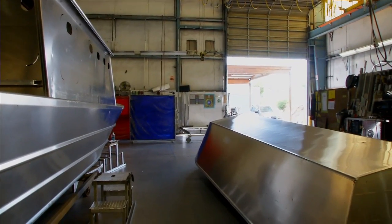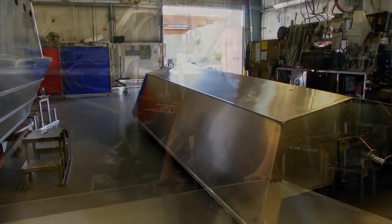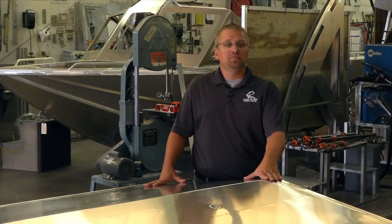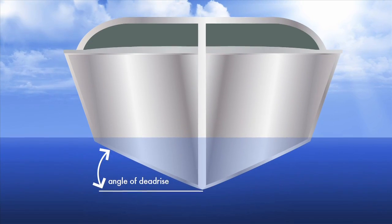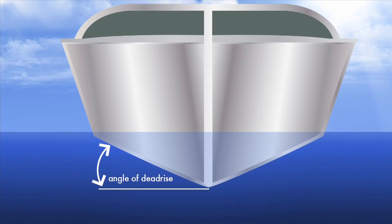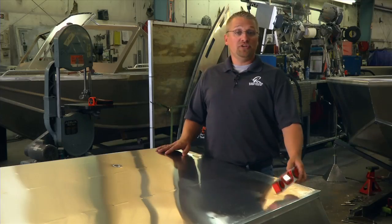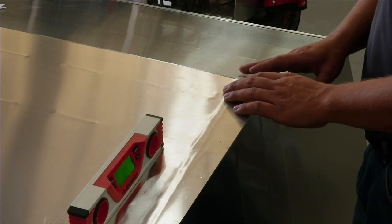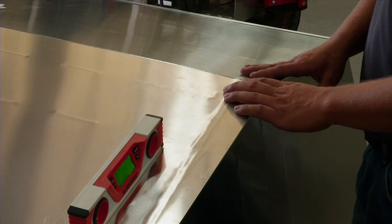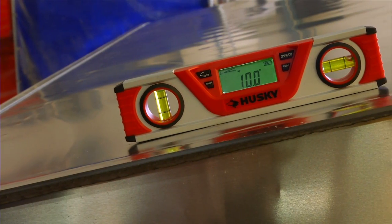Let's take a close look at the underside of a couple of boat hulls in construction. By definition, deadrise is a measurement of the degree of angle of two surfaces. In the case of a boat, deadrise is the degree of angle the bottom rises from a horizontal plane. The center of a boat's hull is the keel. We can use a digital protractor to measure the degree of deadrise on this hull. These two planes are engineered to come together at a predetermined angle — in this case, at this point on the hull, the degree of deadrise is 10 degrees.